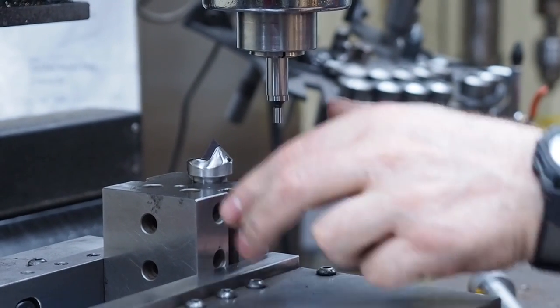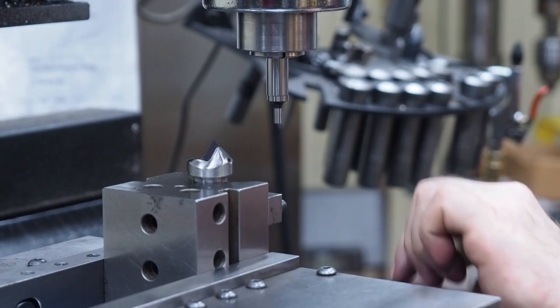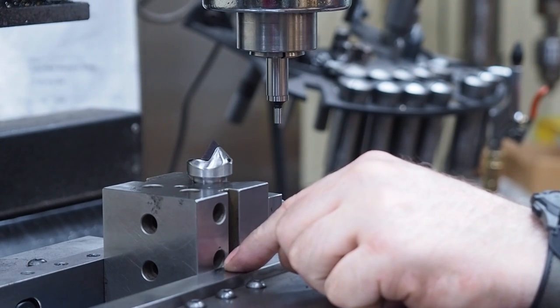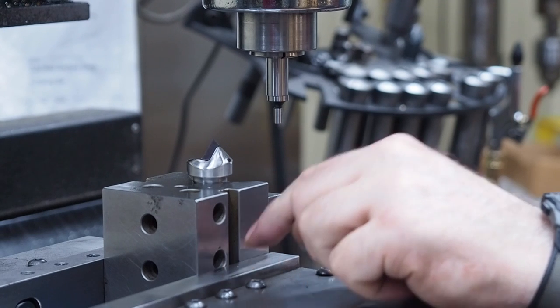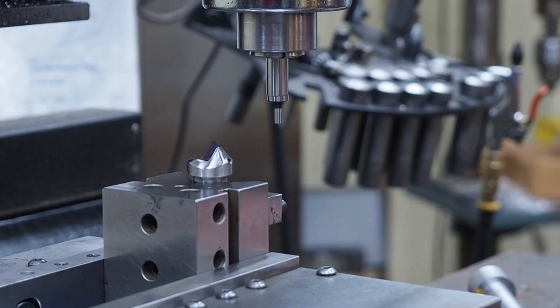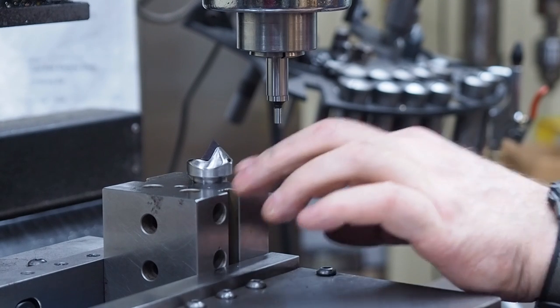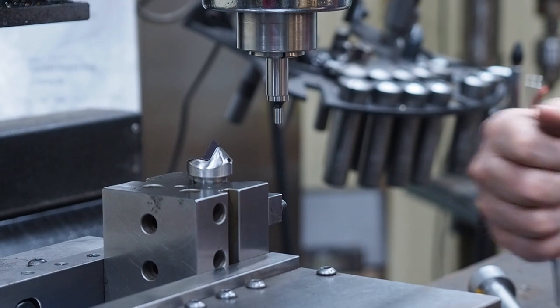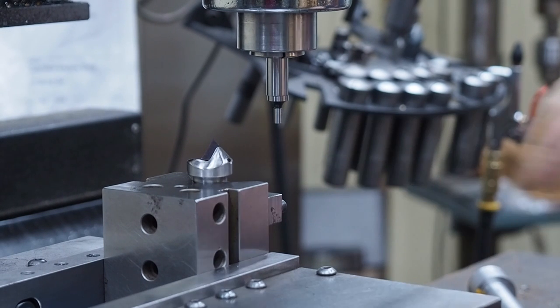Because if you use the V-block the other way and you put something with a bigger diameter and you're pushing into it with this jaw, it doesn't take a whole lot of pressure in this direction against those 45s. If the V-block is like 60 Rockwell or higher, I've seen people put so much pressure on there, not realizing what they're doing, and the V-block would split in half. This way you'll never have that problem.